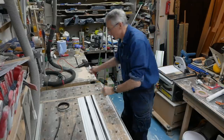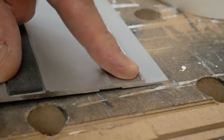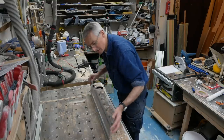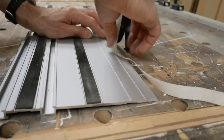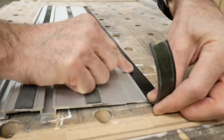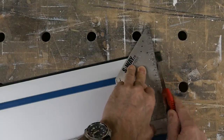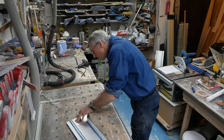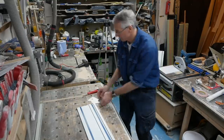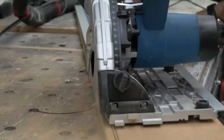That's actually come off extremely cleanly. There's a little rib on the underside of the rail that you can see — the splinter guard just settles against that naturally and gives the right overhang for you to trim back afterwards. And there we are with the splinter guard changed. We can trim that back in the usual way on a spoiler board.